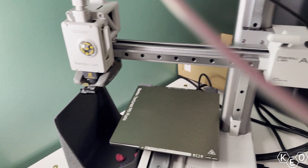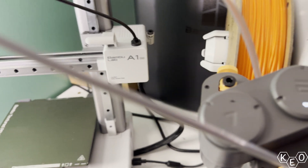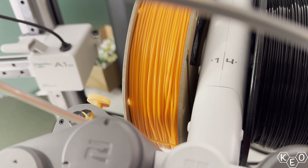But for what we're doing, it's not super great. There's no motor on the AMS that's going to help overcome the tension of that spring — using the pass-through only allows the motor on the tool head to overcome the drag of that spring as well as any drag of a foot of bowden tube. My solution: mount that sucker backwards. Instead of fighting the spring, the motor is going to assist in feeding the filament. We're not going to have any unspooling issues because we're not doing multi-color.